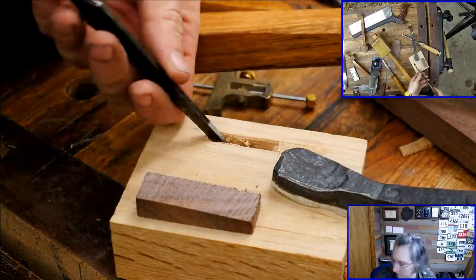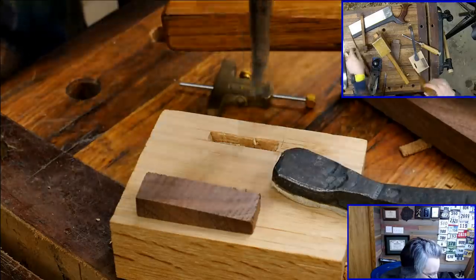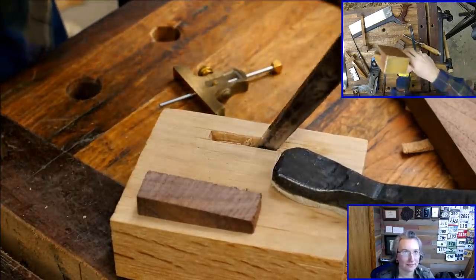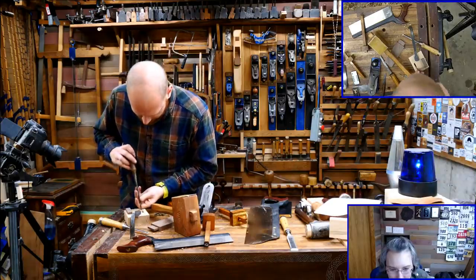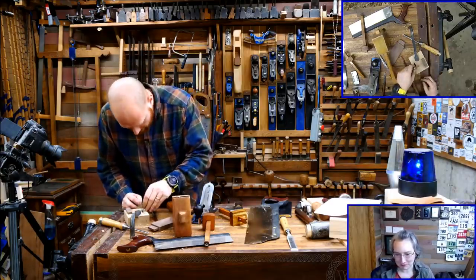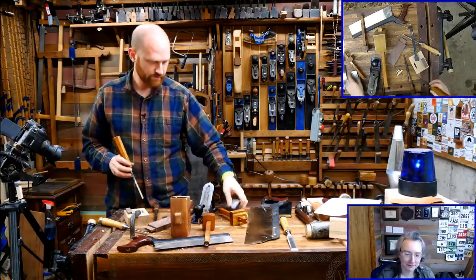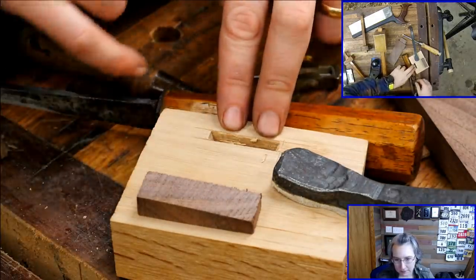If you have a smaller chisel, it's sometimes good for getting in there and cleaning out chips at the bottom. Checking depth — it went a little too deep, about a 32nd of an inch off at one point. Now the two sides of this are coming at an angle, and I have about three-quarters of an inch at the bottom at the right depth. Rather than keeping this bevel out here, I'm going to turn it around, put the chisel at a bit of an angle, get this into a vertical line — splitting the remaining material in half and going right into the marking gauge line.